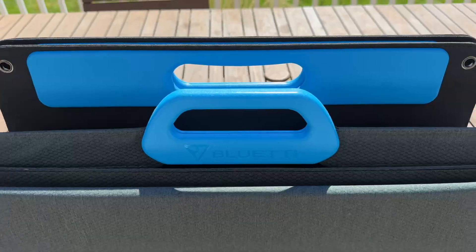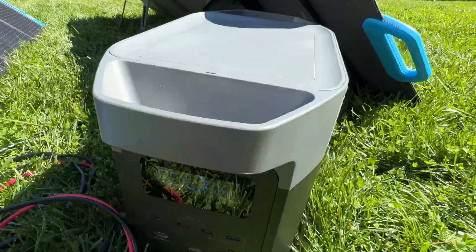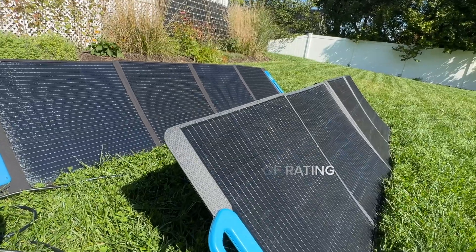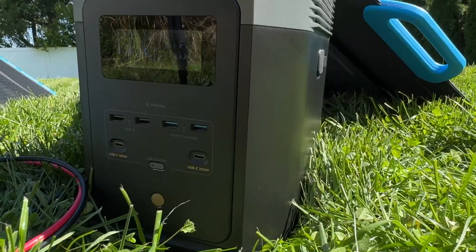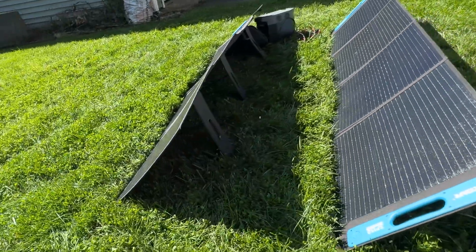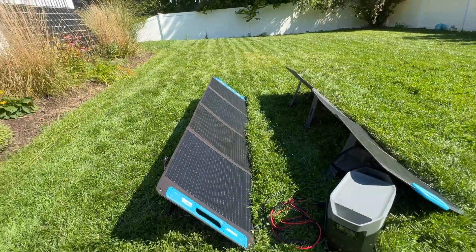To test this theory I compared these two side by side. When folded they're very similar in size; unfolded they're basically the same size as well. The Bluetti panel output 130 watts when cool but quickly dropped to 124 watts, which is only 62% of its 200 watt rating. The xStar SP150 output 132 watts even when hot, which is 88% of its rating. These are basically the same size yet the SP150 had slightly more output, telling me this is actually a 200 watt panel that xStar has conservatively rated at 150 watts. I asked xStar about this and they confirmed that's the case, so I really like how they conservatively rate their panels so they easily hit their rated output in the real world.